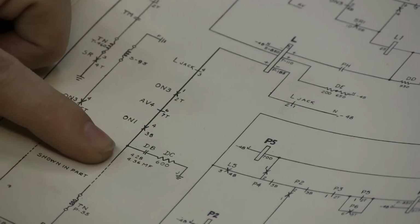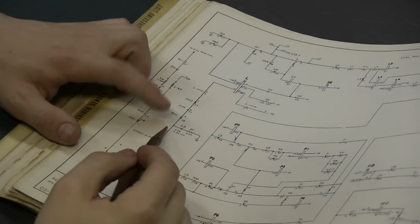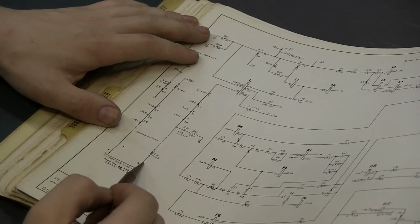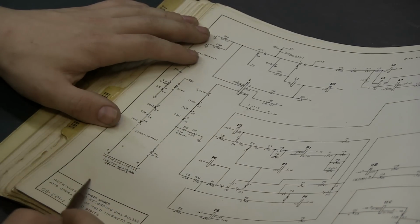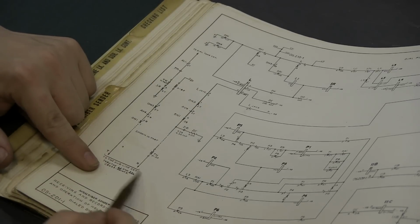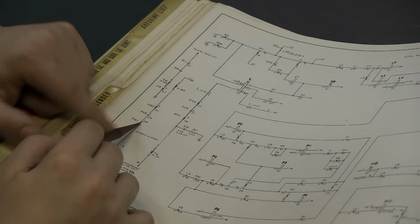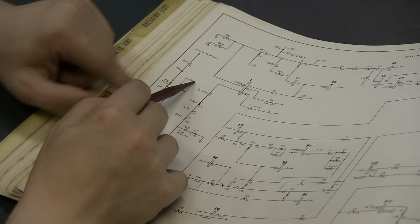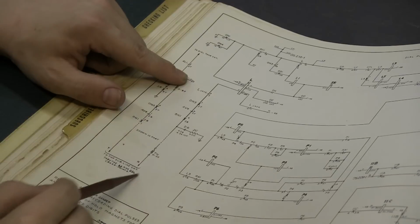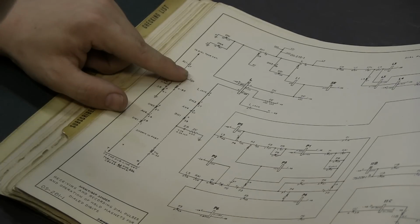I'm going to zoom out a bit. Out of the sender, out of the central office, through the subscriber's dial, which is not shown on this diagram, then back into the central office, into the sender, and to ground. So this is the primary operating path for this relay.